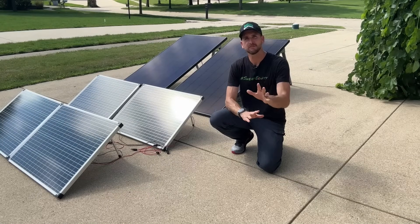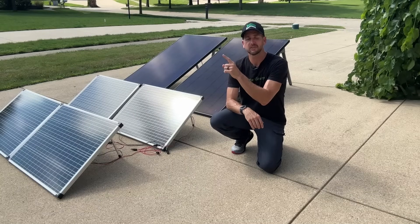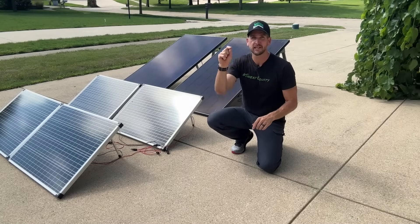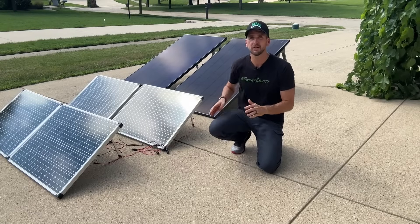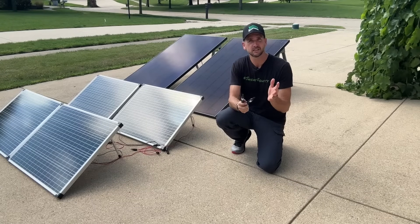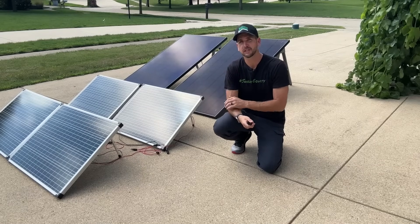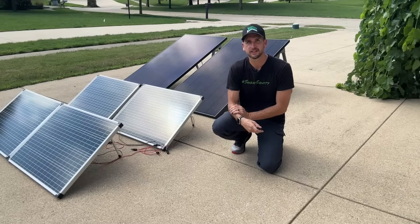Hopefully that helped you out. If you need a little more on the wiring side, check out this video where we go through series, parallel, and series-parallel with actual examples drawn out on a dry erase board. Also, if you're going to be doing parallel wiring, you should be using inline fusing and sizing those out correctly — check out that video to help you get the right inline fuses to protect your system. Thanks for joining me and we'll catch you on one of those next videos. Take care.